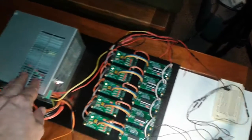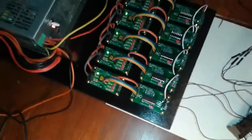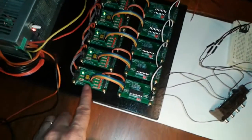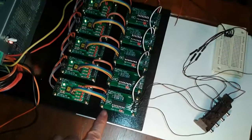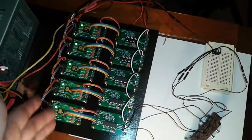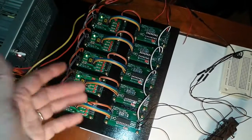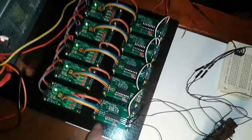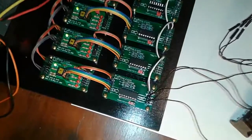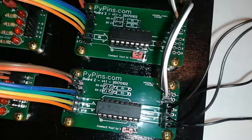This is an old ATX power supply. I'll put a switch on it and a light. And then these are the old boards that you saw, and here are the new boards. This goes a long way — I've got five channels running here, so I can run five stepper motors. These are the microchips doing the work, getting the signal from the computer. And then these are the power boards, so they can handle up to an amp per channel.